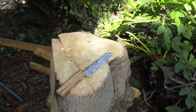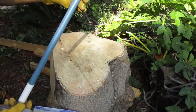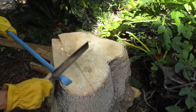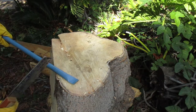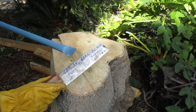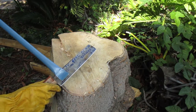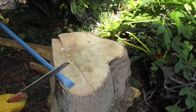You have to push it a little to know what it's capable of. I'm going to do — I'm not sure if I'm going to break it — but this is some broomstick and thin metal. I've done this before. Let me flatten it — pretty flat — so I can go right through it. One flatten, and one right there. Well, if I hit this thing and it messes up, then I stop. I don't want damage. But again, this is very thin — 15 degrees per side. And if you are at 20 degrees per side, it's about two and a half times more stiffness or strength by volume. Big difference between this and also the thickness behind the edge. So it's really substantial compared to other more thicker geometries.